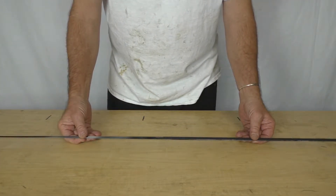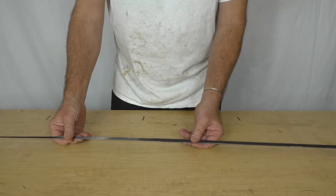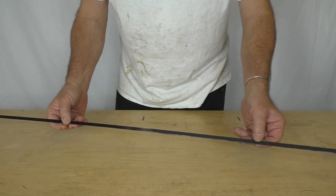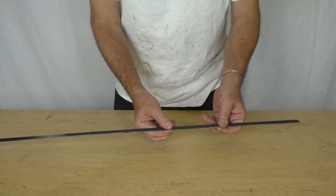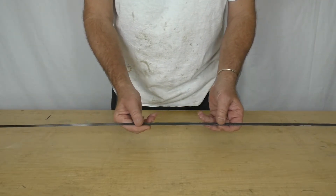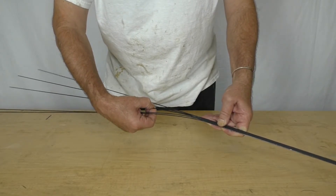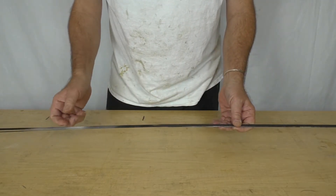And we're back. I've removed the bundle of carbon fiber rods from the mold. Everything's cured up — I've trimmed off the edges of the carbon fiber cloth that's bonding the rods together. Overall, I'm very pleased with the results. The cloth is nice and tight to the rods — there's no dip in between the rods, and the epoxy resin filled in quite nicely. I can feel with my hands there's a slight curve to this, representing the correct shape of the airfoil, which I'm very pleased with. It mimicked that shape quite well — it was very easy to mold it on the same mold used to make the D-tube. The angle cut on the carbon fiber fabric is working as expected — these rods will flare out on an angle, each one beginning its bend at a slightly different location.